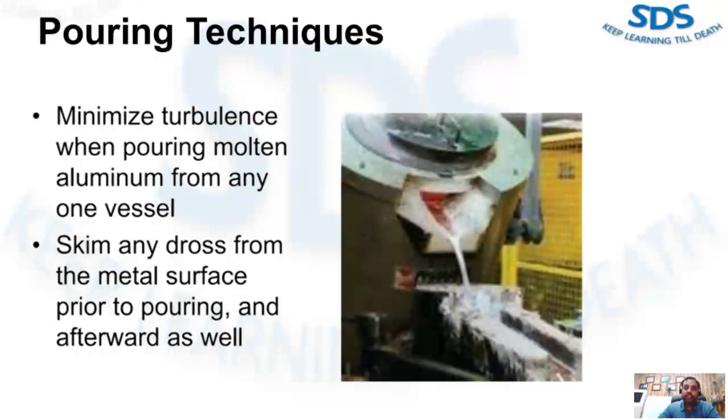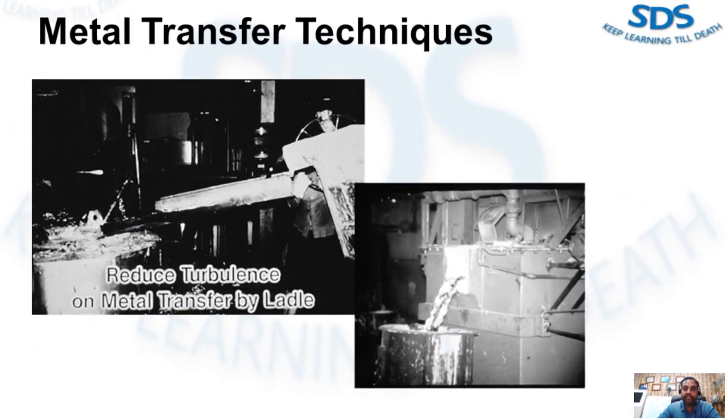The pouring operation should be accomplished with as smooth a flow of metal as possible, minimizing pouring height and without creating splash into the receiving vessel. Dross formation during pouring, while inevitable, must be minimized. There are many methods for transferring metal from the central melting area to the die casting machine holding furnace, and many systems available to transfer metal from the holding pot into the shot sleeve. Transferring metal with a minimum amount of turbulence to keep oxidation and metal loss as small as possible is most important. Pressurized systems for transferring metal from a large furnace to a delivery ladle are preferred.